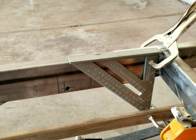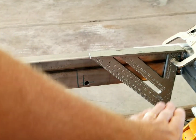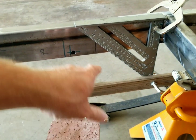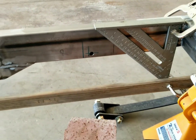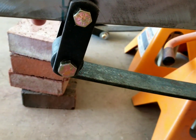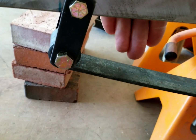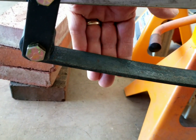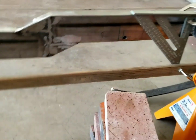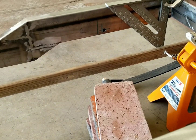We're not going to make a bunch of bends — this will be one piece of aluminum from here back, and another piece from here forward for the drop part. The floor will all be one piece since I have a big enough sheet of aluminum. There won't be any joints on the floor, but there will be a small joint where the shackle is anyway. The aluminum can be cut right there, then the other piece spaced in slightly so the spring will clear it as it goes through its motion. Making the floor shallower is an option, but having your feet elevated above your butt is a little uncomfortable.